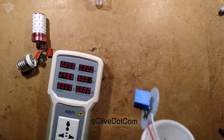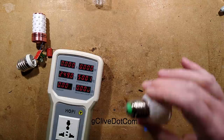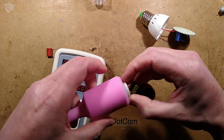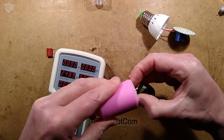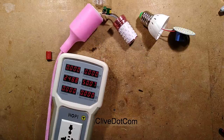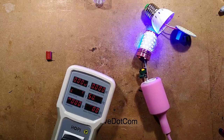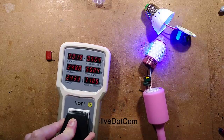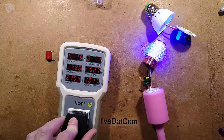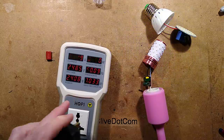What is this one going to do? It's either going to go bang or draw significantly lower current — probably more like 2 watts, I would guess. Let's find out. I'll screw it into this unplugged lamp holder and hope that my solder connection didn't do anything else while I was making it, because this could technically go kapot. It lit! It's dropped down to 2.4 watts, which is a lot more acceptable. That's going to last a lot longer, and it still looks nice and bright and blue. That's a good result.